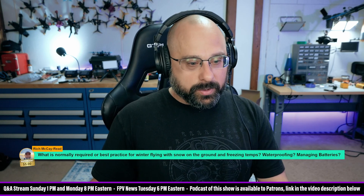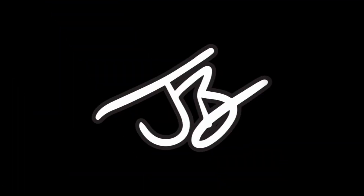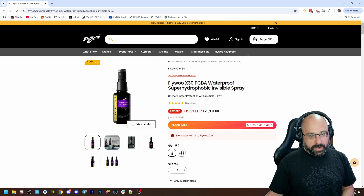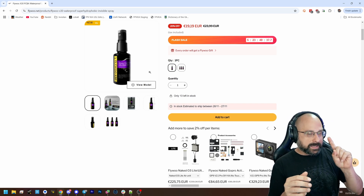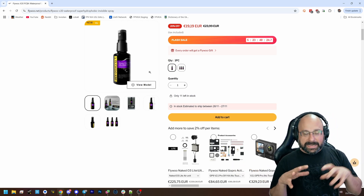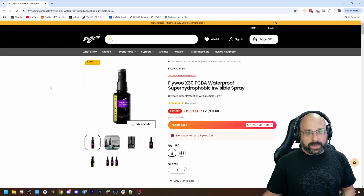You could also use something like the Flywoo Hydrophobic Spray. This stuff keeps water off your drone, and you can just spray it anywhere — it doesn't break anything. The trade-off is that you're expected to apply it every time you fly. The reason you can spray it on connectors without ruining them is it's very easy to scrape off. When you plug a connector in, it basically scrapes off — and that also means while you're flying, crashing, and handling your drone, it's getting scraped off. So you spritz it all over your electronics and they're protected, theoretically. It's clearly not going to be as good as conformal coating, but it's going to be a lot easier to live with.